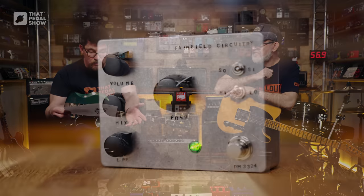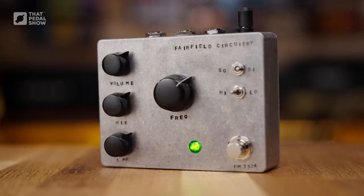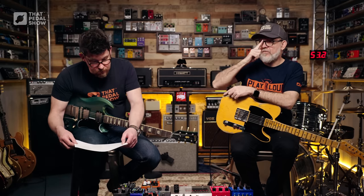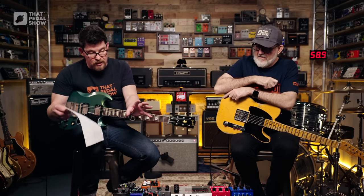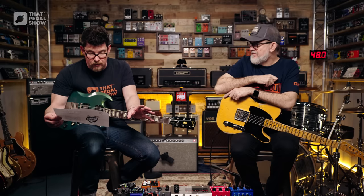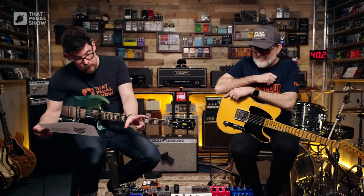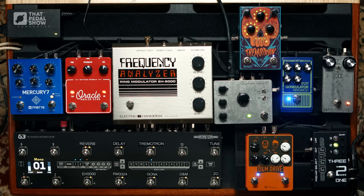Frequency control selects the oscillator's rate and the shape of the waveform sent to the analog multiplier, with the square and sine. So a square wave and a sine wave. There are two different waveform shapes. So we've got two ranges of the operating range of the VCO, and then two wave shapes. The rest of it should be fairly straightforward.